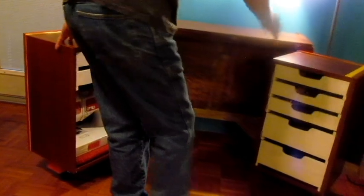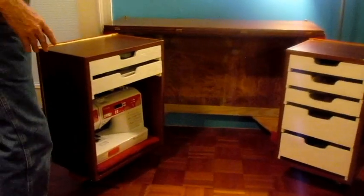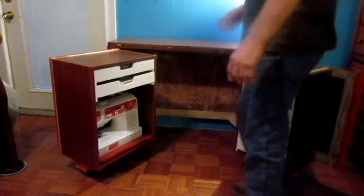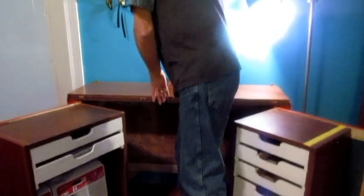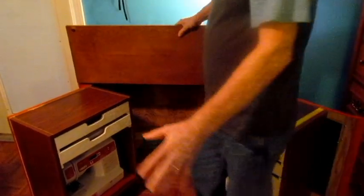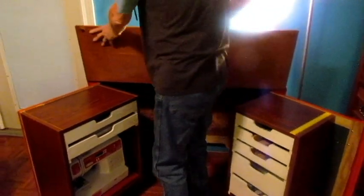And as I said, the small butt hinges I used on it don't take all the weight because I have a wheel under this end of each of the cabinet portions that it rolls on, and it takes the weight away from the whole thing. And the top of it is 14 inches wide, and I decided to make a double top and hinge the top of it. Because the top of this one is 30 inches high and the side cabinets are about an inch lower, I added a peg on each corner here so that when I lay it out, it meets the cabinets and becomes level. So it gives her a 28 by 48 inch space to work.